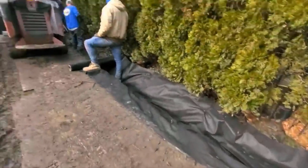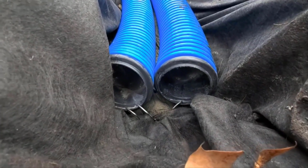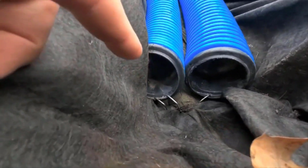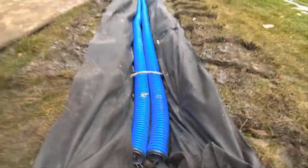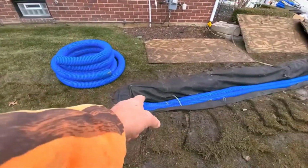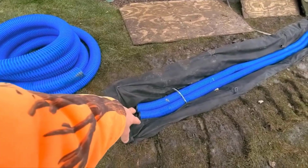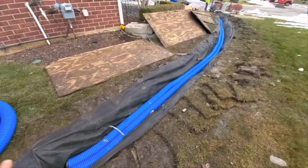This pipe is unique. This pipe is indestructible, and then you can just go ahead and put some stone over top. All right, so the end plugs that go in the Baughman high octane, that's what they look like. Everybody always says, how do you start out the drainage system? Right there. You just plug it. That's it. Internal end plug. Then you can take your fabric pins or staples and just staple them down. You can see that they went under the sprinkler lines right there. You can see how the sod's cut off and laid neatly to the one side. The right side of this trench is going to be super easy to put back together.